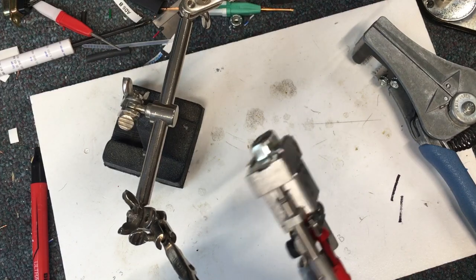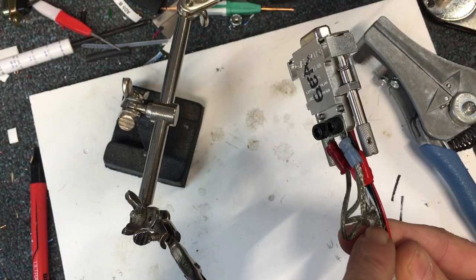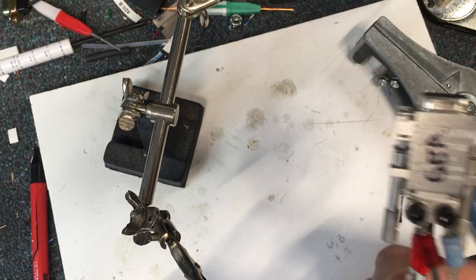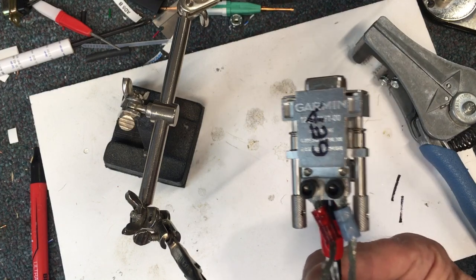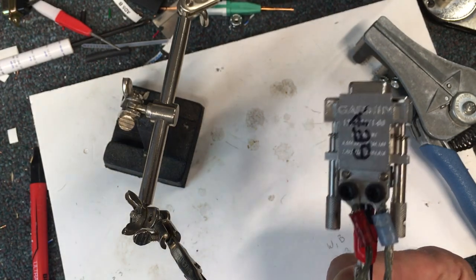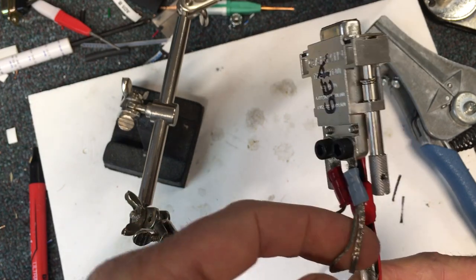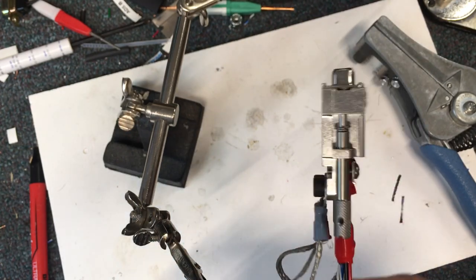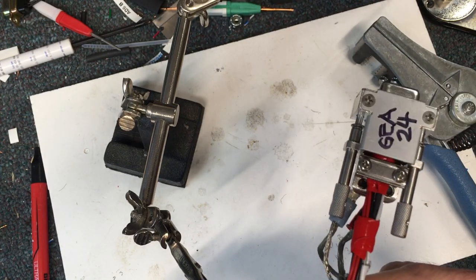I can show you on this one — this is for my engine analyzer, it's pretty much already done. You can see the CAN bus wire coming right up here and it's daisy chained. This one goes from the engine analyzer out to an auxiliary disconnect connector that goes to the wing for the roll servo. Those two shields right there are probably both from the CAN bus and they just go into that ring terminal which gets screwed to the back shell — that's what it'll look like on that autopilot we just did. That's it for now, see you next time.